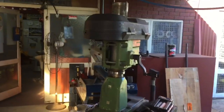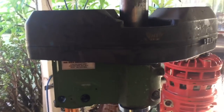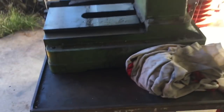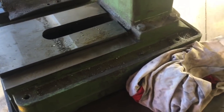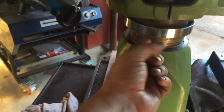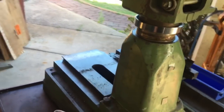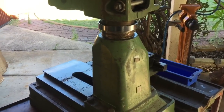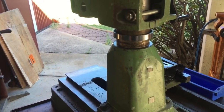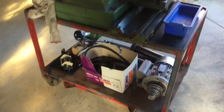Bruce and I have been brainstorming on how to fix the round column mill problem — how to keep the head in alignment as you lift and lower the head. We've got a prototype that we're putting together, and very soon we might have a product that will be available to solve this problem. Our goal is that it will be a retrofittable product, probably just lifting up this column, fixing onto the side, and positioned fairly similar to quill distance out from the round column, so we can try and get better than a thousandth repeatability when you lift and lower the head. I'll let Bruce tell us more about that once we've made some progress on the plans. Thanks for watching, catch you next time.